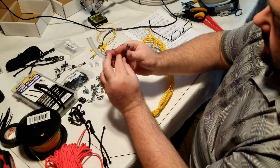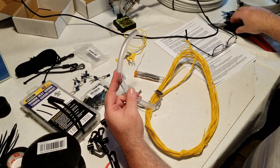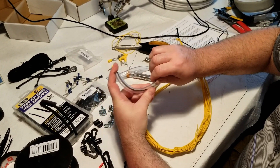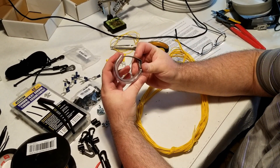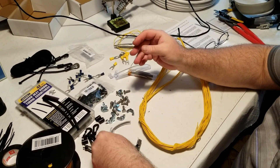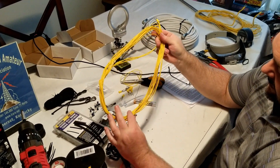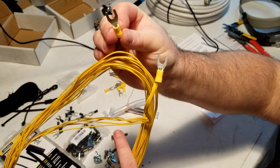In this section I'm showing a finished section of the radials I put together — I did several of those bundles. I'm showing the tubing that Callum supplies with the kit. It's just fish tank tubing, but you cut that to length. You've got the stainless steel hose clamps — slip it on as you can see here. It gives a lot of good friction to hold the pole sections together for longer-term deployments, and also helps protect the pole from the sharp edges of the hose clamps. One of the element radial sets — you can see a couple more in the background. Just some simple assembly steps: putting on the ground plate and radiating plate, a few screws and nuts. There's nothing very complicated with this kit.